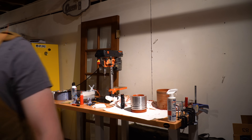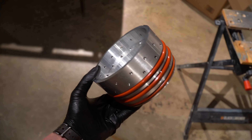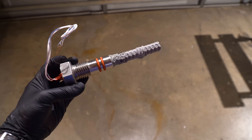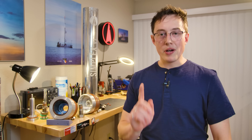In the next video, we're going to talk about the opposite end of the rocket motor — the forward closure. This is the part that holds all of the pressure in at the top, but it also holds the rocket motor igniter and the pressure transducers that we can use to measure the pressure inside of the chamber.